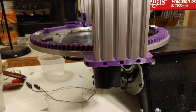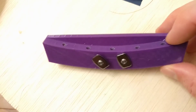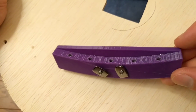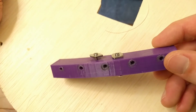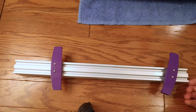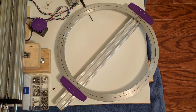Here's a close-up of how the outer ring of the lazy susan is attached to the main frame. It has five M3 screws that are screwed in radially. With the limited tools I had, drilling those radial holes in the lazy susan was a bit of a challenge, but I 3D printed a matching bracket to both clamp the lazy susan and guide those holes.